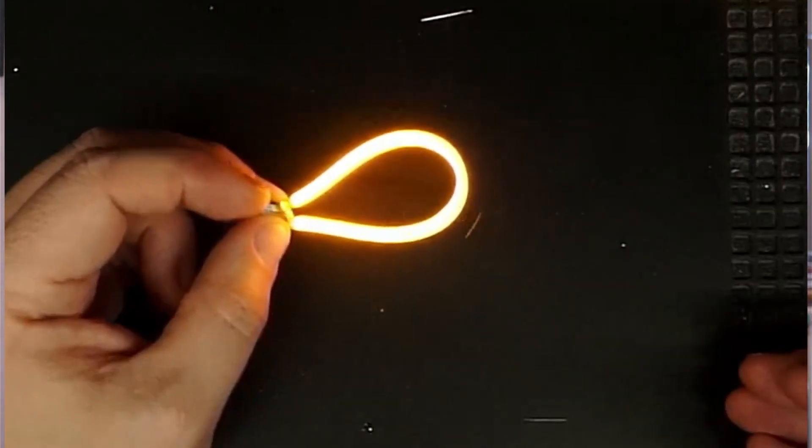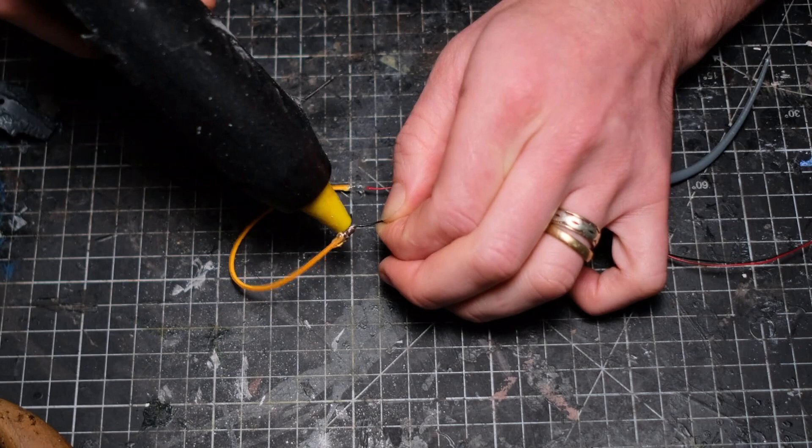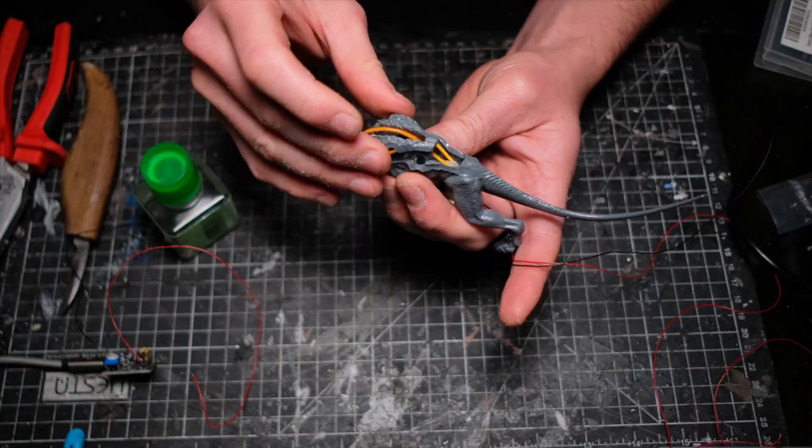The brief from Michael was that he needed flickering lights that look like flames. In my mind that means having yellow LEDs that can shift in brightness on a rapid basis — changing anything between 50 milliseconds to 2 or 3 seconds. This was accomplished using three flexi-lead noodle LEDs from Terrain Tronics, connected up through the model's body and spanned across the back wings of the Balrog.